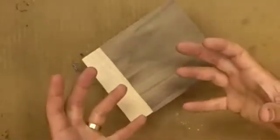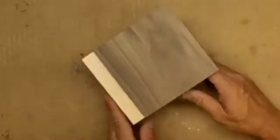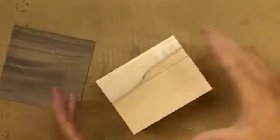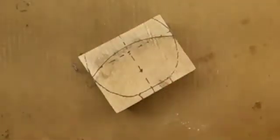When you take the center out and you have an open bowl, it's going to breathe. The wood's always going to breathe. It's going to breathe across the grain. So if it's breathing across the grain this way, but across the grain this way, they're fighting each other and the joint is going to weaken. So you need the wood to be running the same direction, okay? Which means, in this case, it's real easy because I'm bending it across the grain this way. If I had done the cut over here, and there's sometimes a reason why I would want to do that, then I have to bend the wood the other direction. Just changes how you bend it and what you do with it.